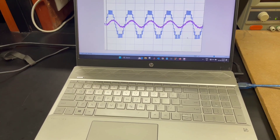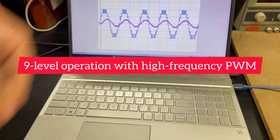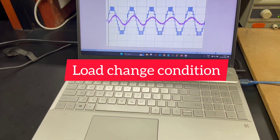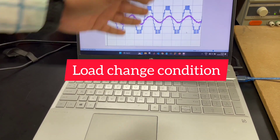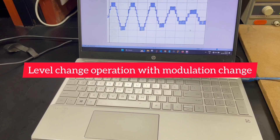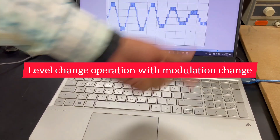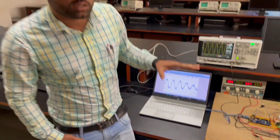Some other results are taken with high-frequency PWM technique. There is another PWM technique implemented — the phase disposition PWM technique. Here you can see the result taken with pure inductive load, and the inverter is still working fine with 9-level output. Other results show load changing conditions with a switching frequency of about 5 kHz. Additionally, when there is a change in modulation index, this inverter produces different levels: first 9 levels, then 7 levels, and when the modulation index is decreased further, only 5-level output.